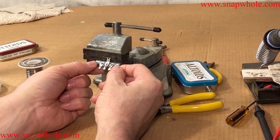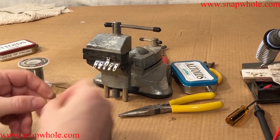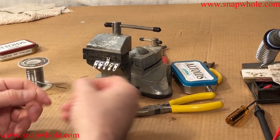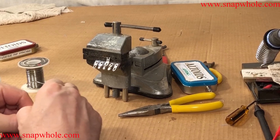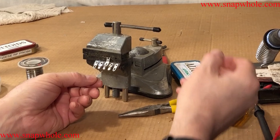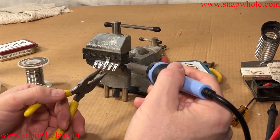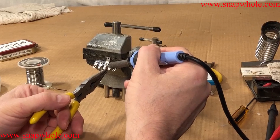I use this five-position clip instead of a circuit board because a circuit board is not needed. And I have a 78L09 — this isn't a high current regulator, but that's okay, I don't need high current. So I'm going to solder this straight onto here. It makes sense to put ground on first because it establishes mechanical contact that will hold it for the rest of the soldering.